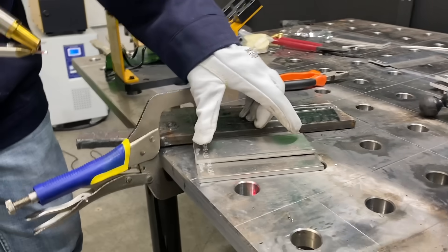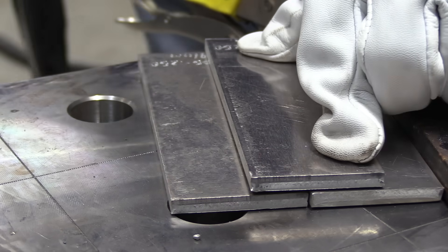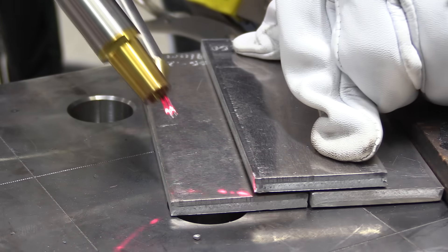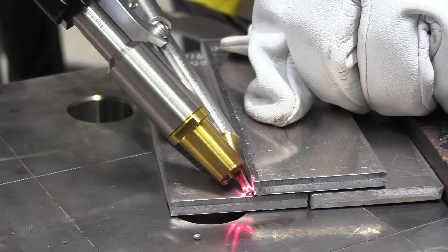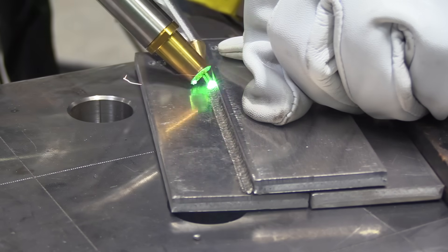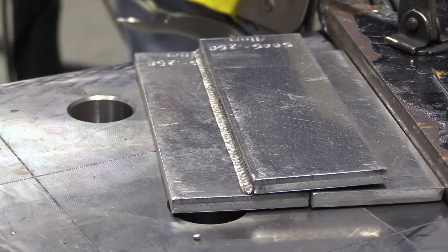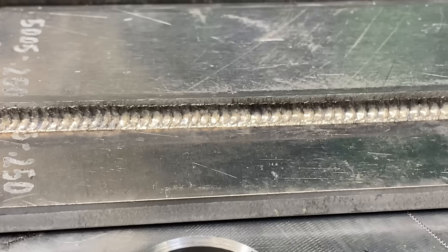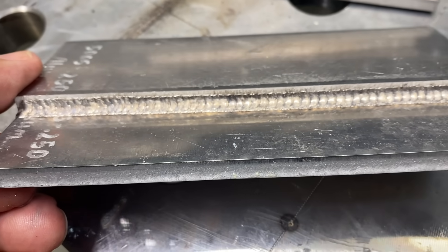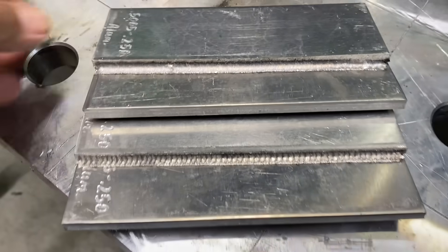Let's look at another angle — same joint, same material, slightly different settings. I brought my camera along to try to get some close-up arc shots, but by the time I got started the welds were pretty much over; this thing is just so much faster than TIG. With aluminum, normally with TIG and MIG you lose a little strength in the heat-affected zone because the metal gets hot enough to anneal and recrystallize — in some cases that's going to be a huge benefit for laser versus TIG. Looking at this weld, it's sunken in — I'd think that got penetration into the root, but the only way to know is to test it.